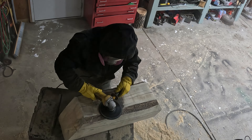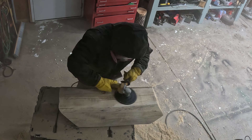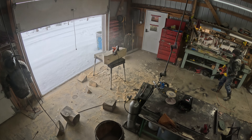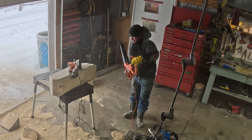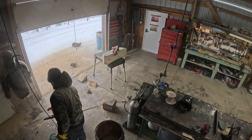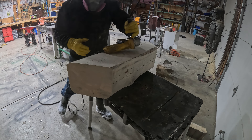I talk a lot about my angle grinder here and using this abrasive sanding disc wheel on it — I think it's a seven inch sanding wheel — and it's just such a great tool. Both of these were pretty dirty, rock-encrusted pieces of wood, and there's nothing else that can take all of that material off without worrying about damage. The angle grinder with 24 grit sandpaper handles it perfectly.